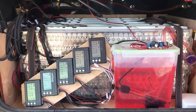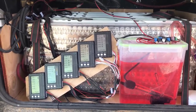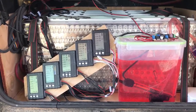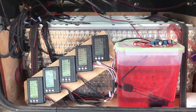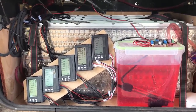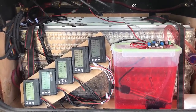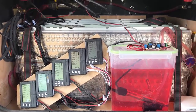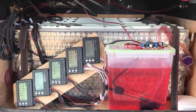Our setting is currently to charge to around 24.2 volts, and the inverter disconnect is at 20 volts. That fits perfectly with the operating range for the Tesla modules, which is between 25.2 and 19.8 volts for normal operation. We do not use the higher part of the charging range because lithium-ion batteries charged to full degrade a lot more than when charged to 80 percent or less. That's also how they're used in the car — only charging to 80 or 90 percent on a regular basis, and only fully charging for a long drive.